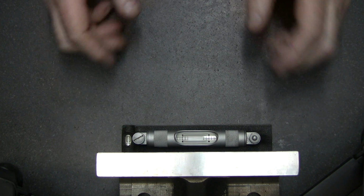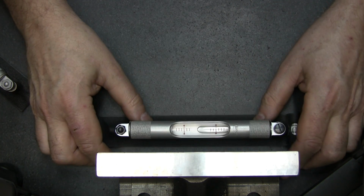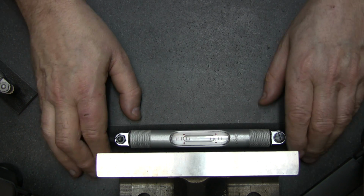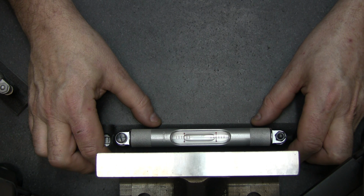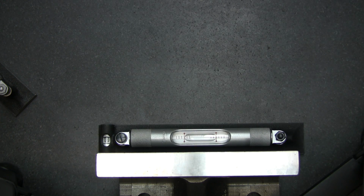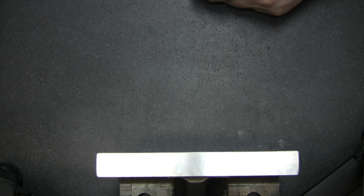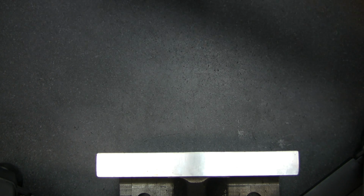And if you get a level like that, whatever size it is, let's see, a 6-incher, an 8-incher. Let's see, we got this, and we know this one's calibrated too. Plate, we're in the level axis of the surface plate, and so on and so on. Maybe just as a curiosity, we're pretty close with these levels. Now I've got one that's a little closer tolerance, the 12-incher. I'll just wipe off the bottom.